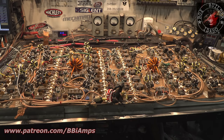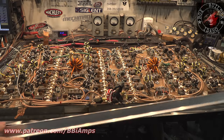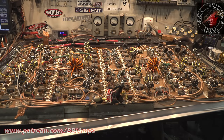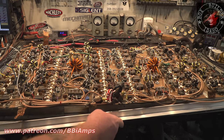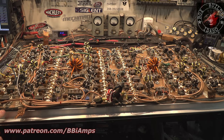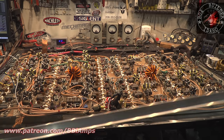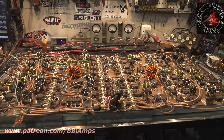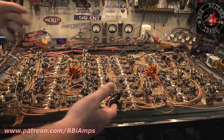All joking aside, I knew that this was going to be the problem from day one. So I went ahead and bought myself a large stick of angle aluminum. It is exactly the same width and height as the under-edged lip of the heatsink, right? This space here. So what I'm going to do is take this large stick and cut two runners that are probably going to be about this long. We'll probably pop rivet it so the bottom of the cabinet can stay smooth, and then we'll bolt into the heat sink on both sides.